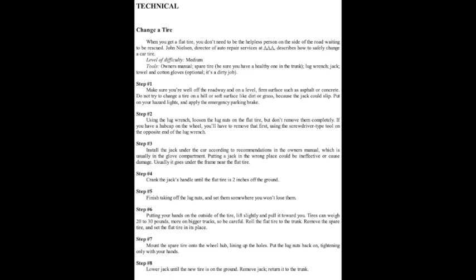Step number 7, once the old parts are yanked, replace with either a new cartridge or new, identical seat, and use the proper tool, likely a 6-sided Allen wrench or a 4-sided wrench. Don't forget to replace the washer too. Step number 8, reinstall the parts in reverse order. Turn on the water, now turn it off. Don't hear that telltale drip? You're a plumbing star.